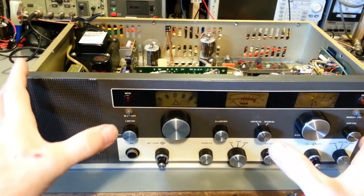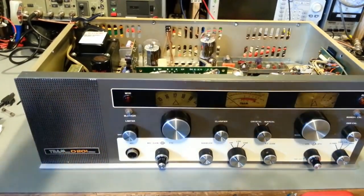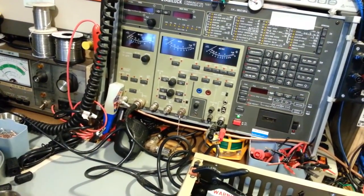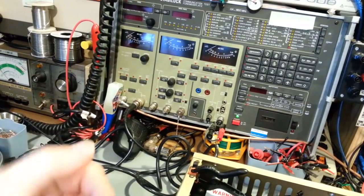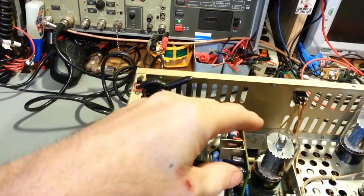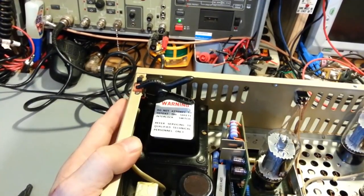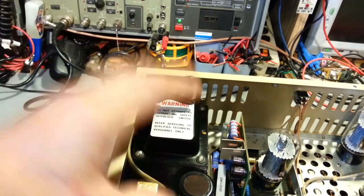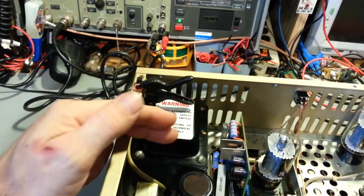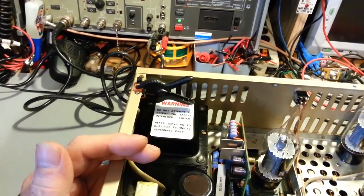So, my procedure for doing this is, turn the radio on, and what we're powering it up with is a variable isolation transformer. For starters, that isolates me back here when I touch the chassis, or if something would go wrong inside the radio. Remember, old tube radio, very high voltage present in here. When you do something like this, a restoration, you're only changing a few parts, electrolytic capacitors and a few of the high wattage resistors. There are a lot of other components in here that could fail, other unknown things you could have missed easily.